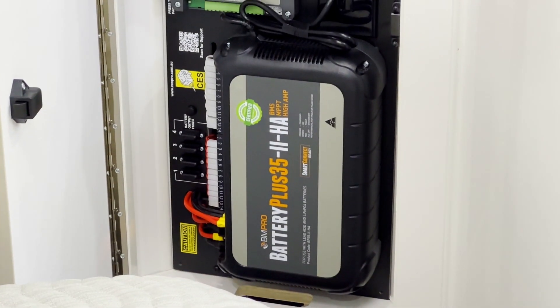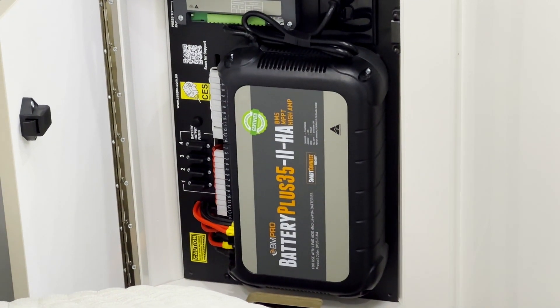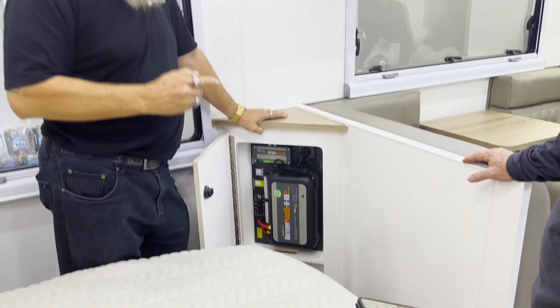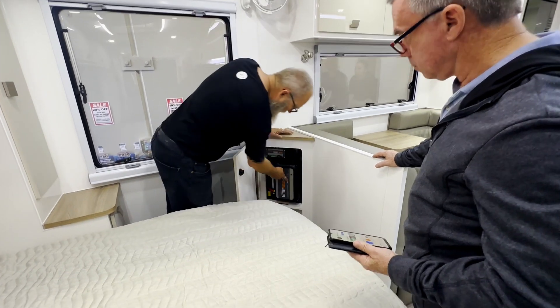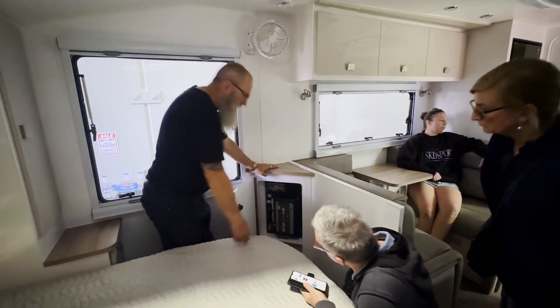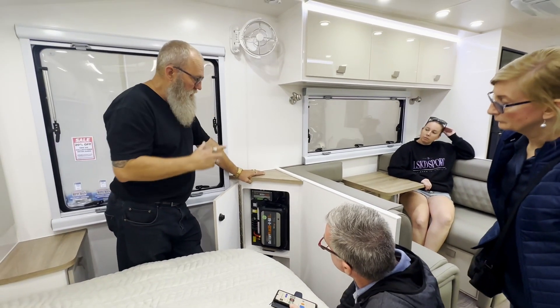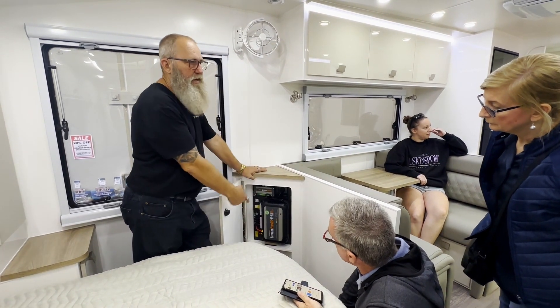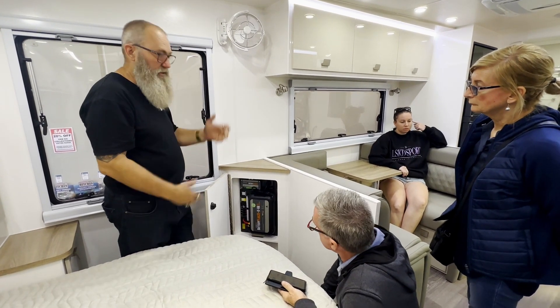This unit is a microprocessor — there are no fuses or relays in it, just basically a mini computer. Of course, they can have problems and faults. To fix it, like any microprocessor, you've got to reboot it. There's a small button on the back right — down where the writing is, there's a data cable, and to the left of that is a little raised nib. Just touch that and it turns off and back on, resetting it. The unit has three different indicator colours: green, yellow, and red. If there is a fault it will blink different numbers. There's no paper manual — download the PDF from their website, which has a troubleshooting sheet explaining what each light and blink code means. Ninety percent of the time it's just hit reboot.